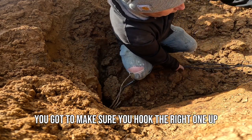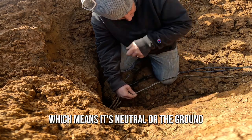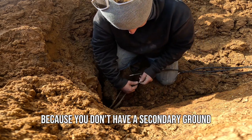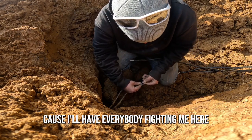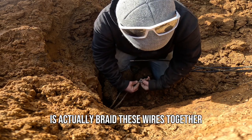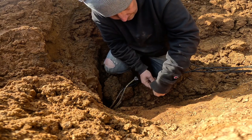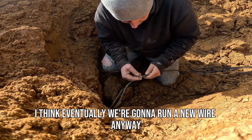This is actually the neutral wire — that's the other problem. When you hit these lines you've got to make sure you hook the right one up. The green stripe means it's the neutral or the ground — it's going to be our ground and our neutral because you don't have a secondary ground with a sub panel. What I'm going to do is actually braid these wires together. Sometimes we use a mechanical fastener but I found that braiding them together works pretty easily and it doesn't hurt anything.